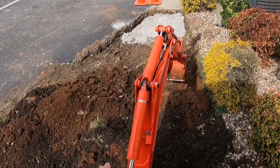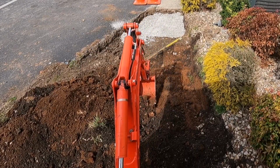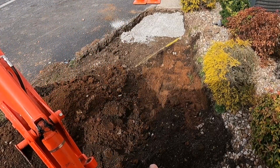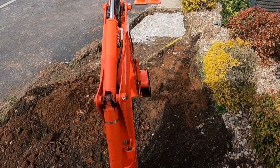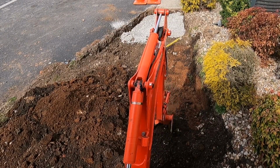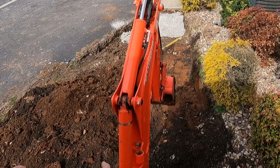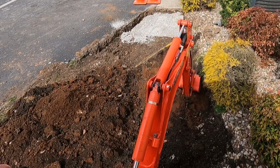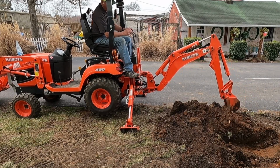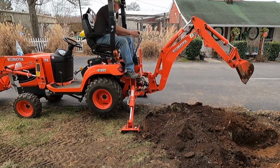This is really the first job I've done using the DeWalt green rotary laser. Here I'm going to cut into an edge again. Right here, I'm really trying to keep my bucket level with the ground. The DeWalt green rotary laser, the part that goes on the tripod, I have no quarrels with that thing. The receiver that's on the little grade stick, man, it just needs some help. It's just so sensitive, and it has trouble. I can't really explain what the deal is, but it's just really hard to get that thing on level, to get it in that spot. I don't really know how to say it to you, but anyway,